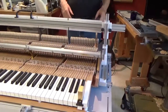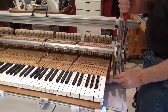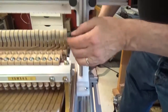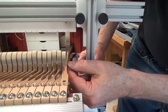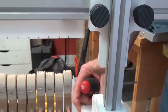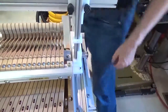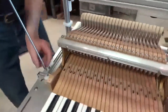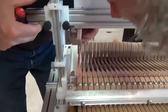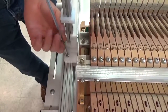Okay, now I'm roughed in. I'm close enough, I believe, to be able to set my stop, because I want this edge to be right in the middle of the crown, right on the strike, so it'll be easy to read. So I'm going to tighten down my stop. Now I can come and go and come back automatically without resetting to the strike. That's smack on the money.